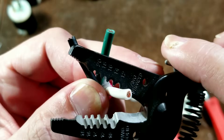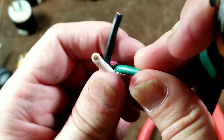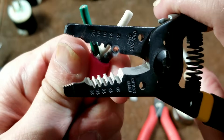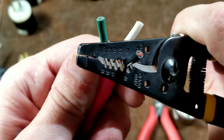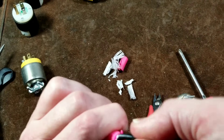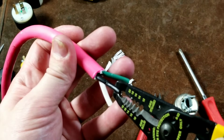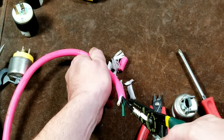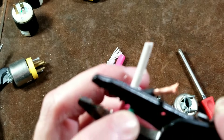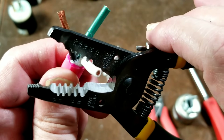When using these style cutters, I actually don't pull on the wire when I cut — I just cinch down like that. I really like to try to not have any broken strands. When you use these to cut and then actually pull off the insulation, nice ones like these green Kleins are so sharp that they'll cut strands of the wire as you try to pull it off. Usually a little twist will get these to cooperate. An additional tip is to cut and then rotate it 90 degrees, then do another cut right at the same spot just to make sure you get through.